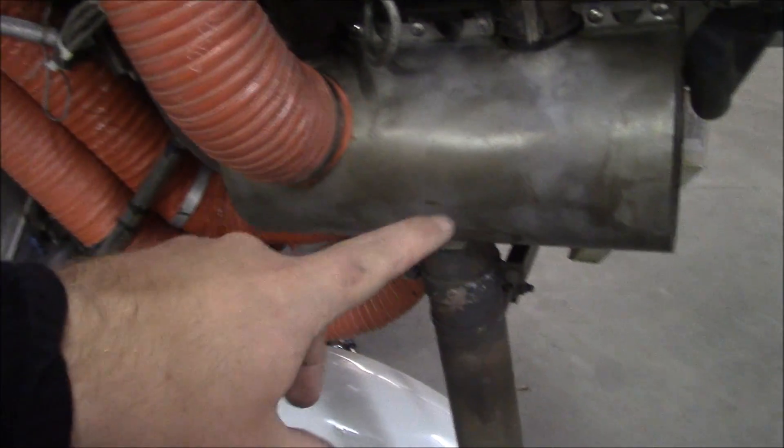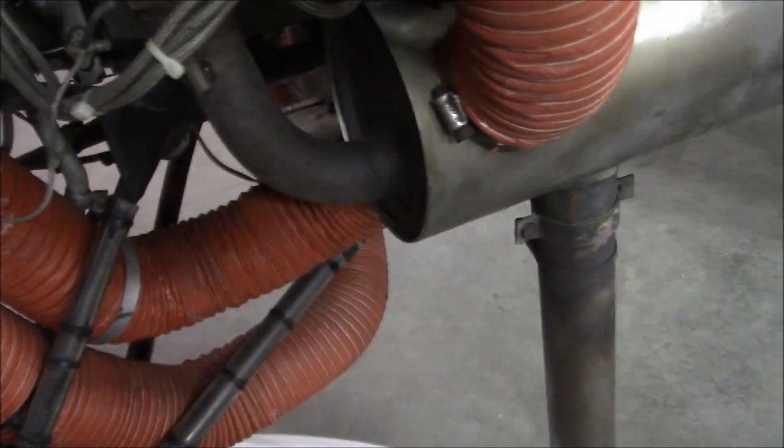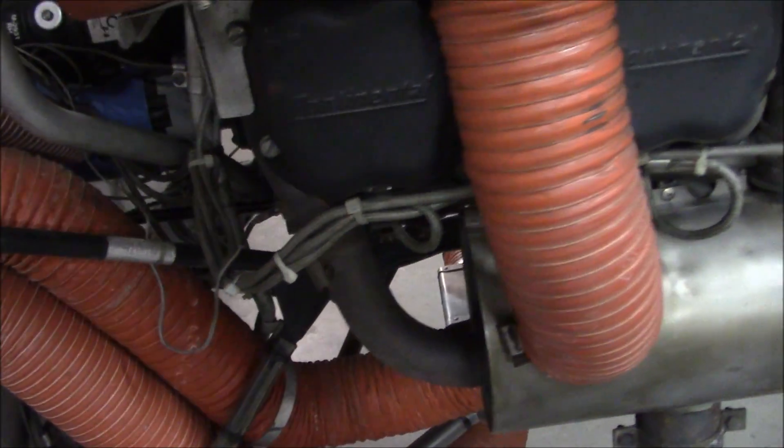It makes the combustion that comes out the sides. Here's the right stack of three exhausts on the right side, and the exhaust goes down here. We also get ram air from the engine going through this orange tube, across this muffler right here, and that gives us heat for cabin heat.